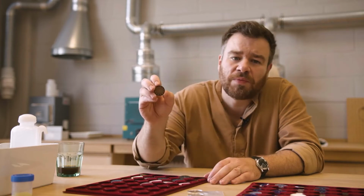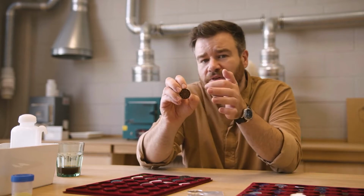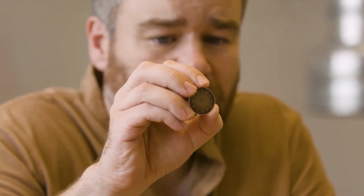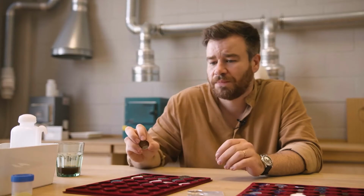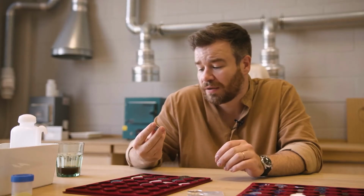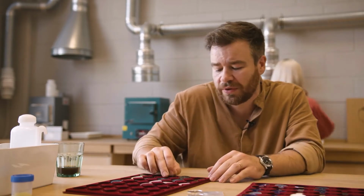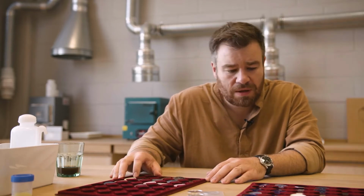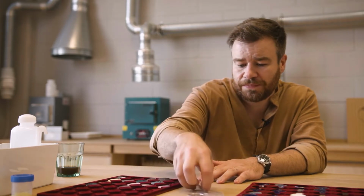There is maybe 1 or 2 tenths of a millimeter difference in thickness of enamel between the center and the outside. So it is really, really fine, and very, very difficult to produce without cracking. Once they're finished, they're actually very robust, but when you're going through the stages of heating up and cooling down, that's when they're vulnerable to breaking. So that was the way that we came across the fumés.